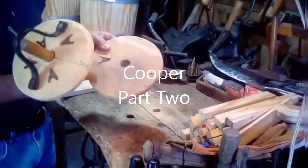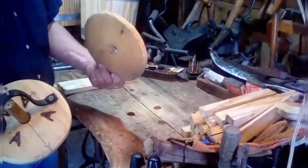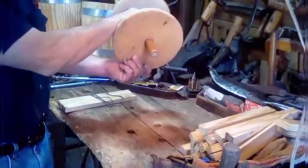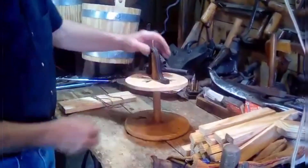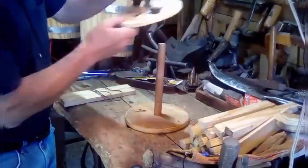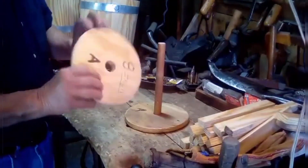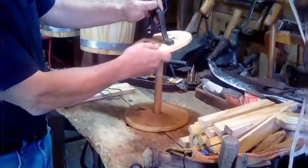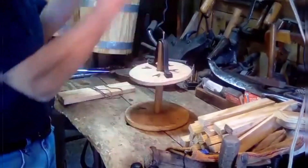We've got a nine-and-a-half-inch circular pattern cut out of a one-inch board. Your dowel goes through that — you've got a hole cut for your dowel — and then you've got a hole in your table that doesn't go all the way through, so it'll sit there. The top part is an eight-inch, same thing, one-inch board. I put rubber up here and drilled a hole in the top of my dowel so it'll hold it up, so when I get ready to take it out I can just lift it out.